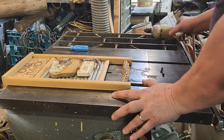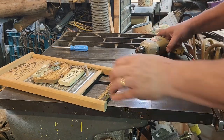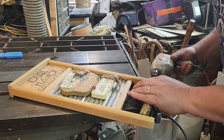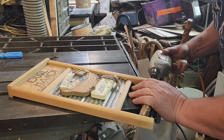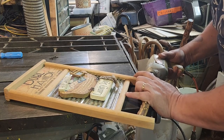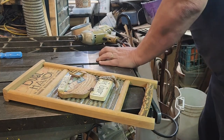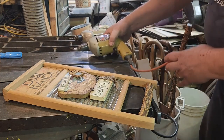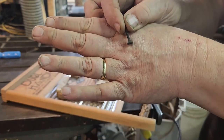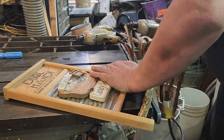So in the meantime, I have a drill that's small, and I'm going to put these screws in there, and I'm just going to drill it. This is just a simple figure out where you want it, and drill in and put in the screw. But it's hardwood, and I don't want it to split, so that's why I'm pre-drilling this. I'm also going to give it a little countersink action, because the heads on these screws are tapered and we can get a good flush mount. Like so.